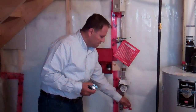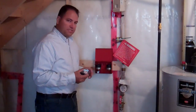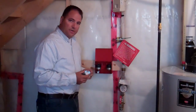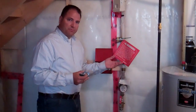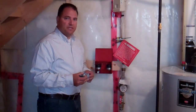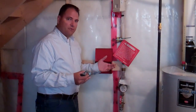We've provided the appropriate socket for your contractor or fire crew to install the head, and that's located right next to the box. Once the head has been reinstalled, water flow can be turned back on and your system is up and running. You may experience some air in some of your lines — simply go to the furthest point of your water system, typically the upstairs bathroom, and run your water for about five minutes to make sure the air is removed from the system.